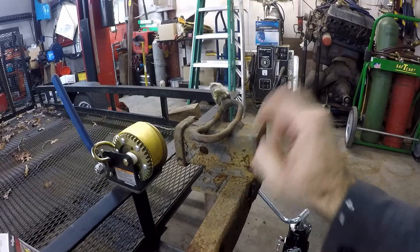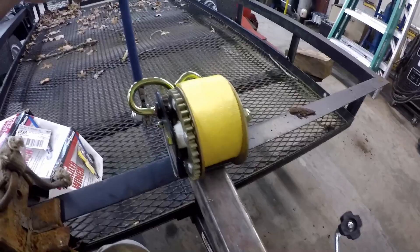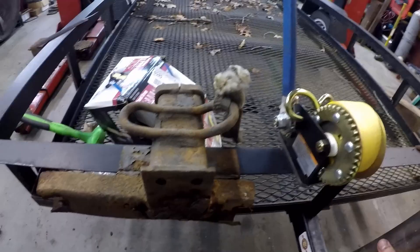This conglomeration is going to be welded on top of that. Of course, all this is going to be cut off and it's just going to be the receiver tube, then the winch itself. I like to use a 2 inch receiver tube for every winch mount on a trailer. Even though this is a light duty winch setup, if I wanted to, I could use a bigger winch off of a bigger trailer on this, or vice versa in a pinch. I pretty much need to get this cleaned up to be welded to my upright.